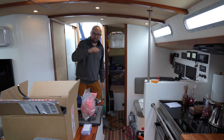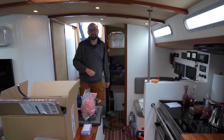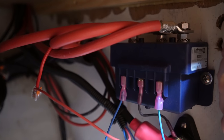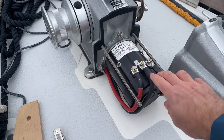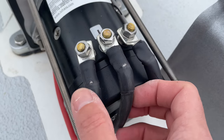Progress has been made both in the forward cabin and also here in the aft cabin. Everything still looks a little bit messy — obviously I'm holding off on cable management until I've seen everything work. That turned out to be a good decision, because when I ran the windlass for the first time the circuit breaker, which I ended up installing under the nav station, immediately tripped. To narrow down the issue I disconnected the cables from the solenoid box going to the windlass — after that the breaker no longer tripped, so I knew it was an issue from there forward. I went up on deck and removed the motor cover, and there I saw the issue: the cover had chafed through the heat shrink on the cable lugs. I solved it by flipping the cable lugs upside down, giving myself just a few more millimeters of clearance.